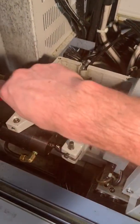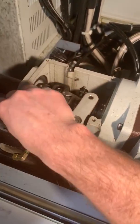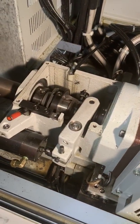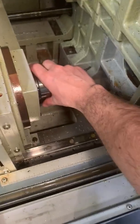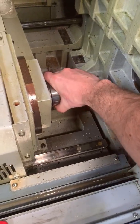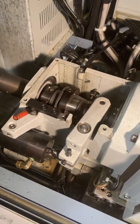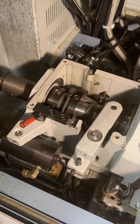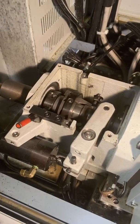Next, you'll want to loosen up the set screw. Once the set screw is loose, now we can make some adjustment. I'm just going to be spinning on the main collet nut and it'll turn in here. You can see it moving, and you can see that that ring is staying in place. So if I were to go this way, it would loosen up the collet.